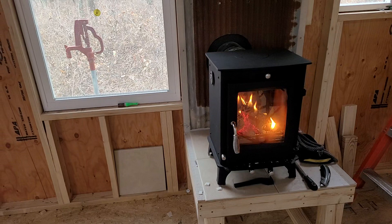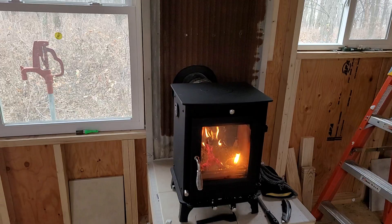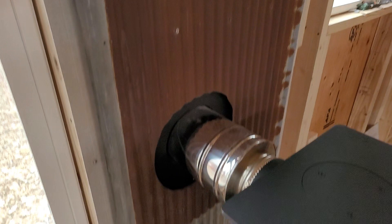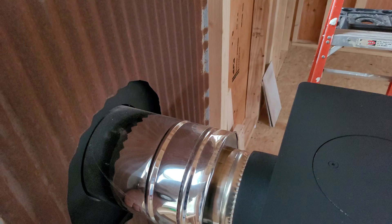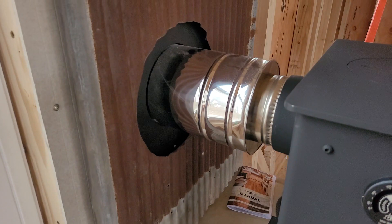From the inside, we took their half-inch cement board recommendations so we could get this thing closer to the wall. On top of that, I put a metal heat deflector on the back as well. There's a one-inch gap behind here and it gets a little warm, but it's doing exactly what it's supposed to do. There's a gap at the bottom so cooler air is washing up the backside of the wall, keeping that back wall panel cool as well.